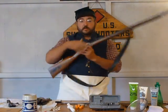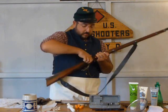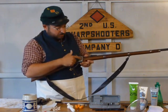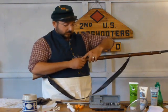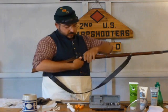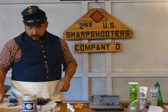Whenever you handle any firearms, make sure your rifle is fully unloaded. I have my block already removed, but for demonstration purposes, I'll install the block again. It's a little gummy because it's had a few rounds put through it. You start by depressing the button on the right-hand side of the block enough to swing your pin loose — if it's been shot a lot, it'll take a little wiggling to come out. If it's brand new or recently cleaned, it's going to come out a lot easier. Then you remove your block and you're ready to get started.